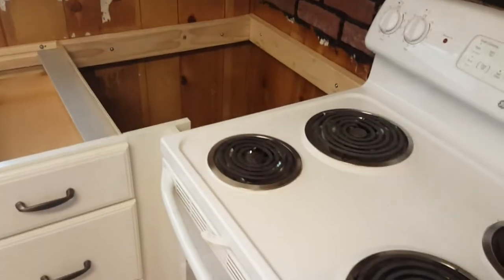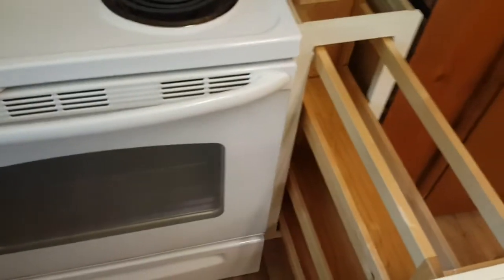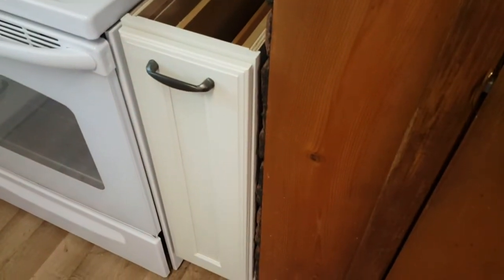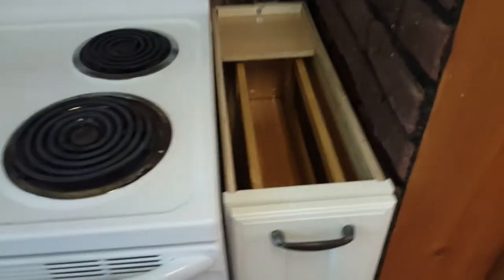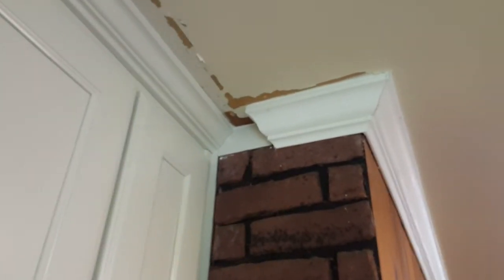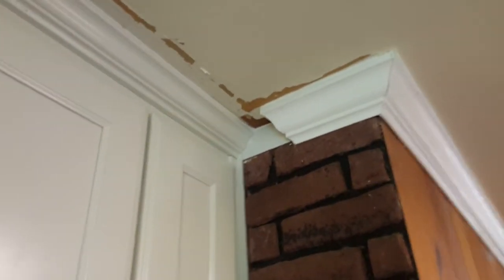As far as the other side of the corner, she did a pullout base pantry. The cabinets actually ended at a brick wall, so it comes out just a little bit past the front of that. We talked to the customer and she's fine with having the countertop turn and make that corner. We did a transition up here in the top with the moldings — same thing, did a return — and then we just took the color of the cabinet extra toe kick and returned that back around the inside.